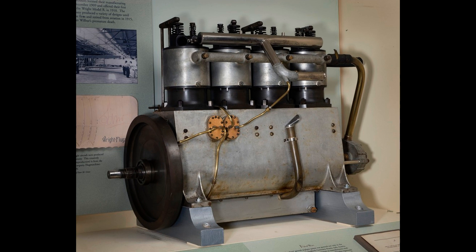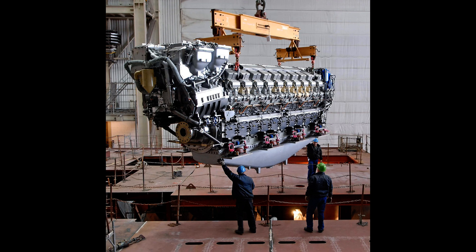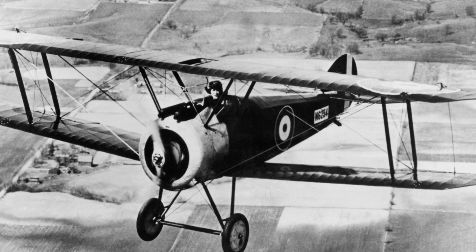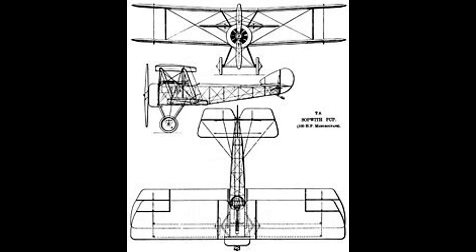The Vertical 4 we talked about earlier displaced 240 cubic inches, or 3.9 liters. But when it comes to aircraft engines, there's an obvious limit to cylinder size. A ship engine may have a small number of massive cylinders displacing thousands of liters each, but that's just not going to work when you're trying to fit your engine in the smallest package possible. The bigger the engine is, the more drag it produces as you shove it through the air. In aviation engineering, everything is compromise.